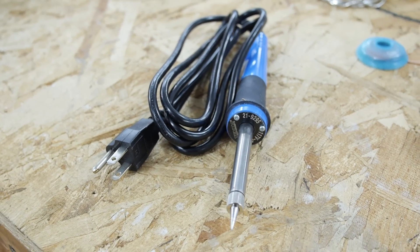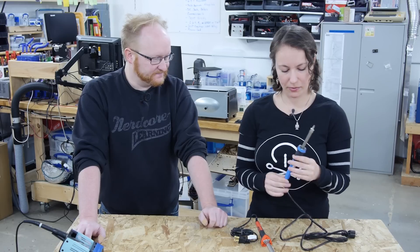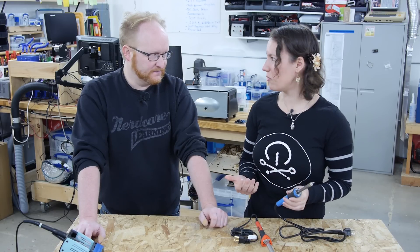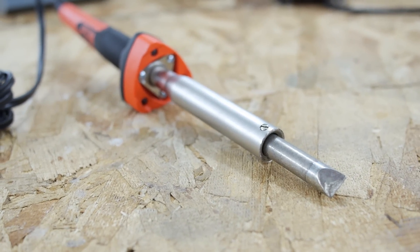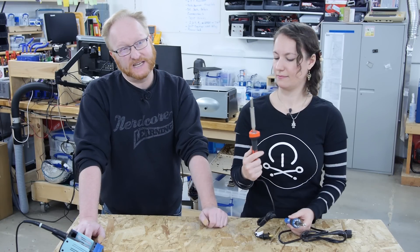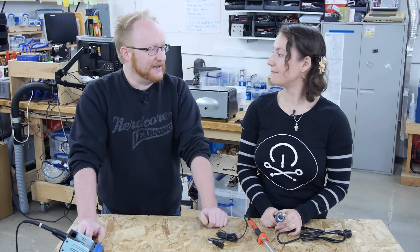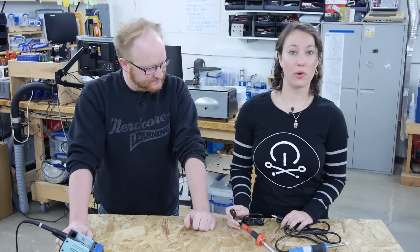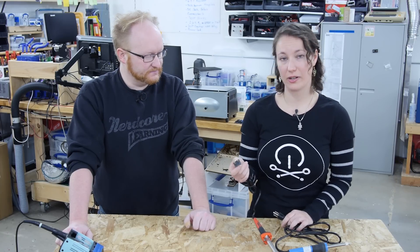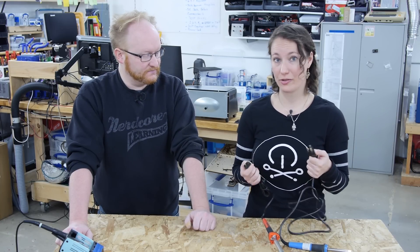That's what most people usually are familiar with when they start. But as far as cheap goes, you don't want to go too cheap. When you're looking at these, they start at about 15 watts, and this one goes up to 80 watts. 80 watts is probably bigger than you'd want to use for electronics — 20 to 40 is probably the sweet spot. Wattage basically tells you how much power it has in order to melt solder; the higher the wattage, the faster it melts. One thing to look for is make sure your soldering iron plug has a ground pin.